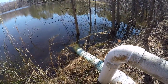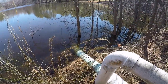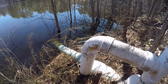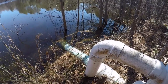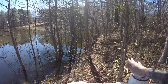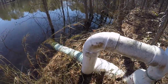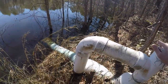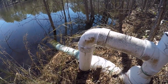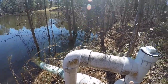And so that's an 8-inch pipe right there that flows down the back side of the dam. And when that thing starts sucking water out of there, I mean, it is really sucking a lot of water, and it does a good job of siphoning it. The problem is that when we determined the height of this, we got it a little bit too close to that area over there on the other side where I just put all that rock. So what happens is this thing starts to siphon out about the same time that it starts coming out of the other side of the lake. And so we got it just a little too close. So what I needed to do was build up that other area down there so that this will take effect first, and it'll start to drain out of this system before it starts to come out of the other end of the lake.